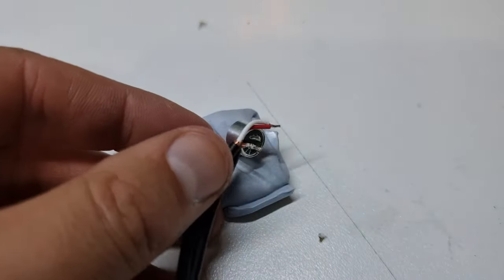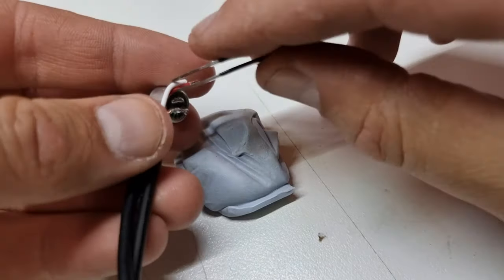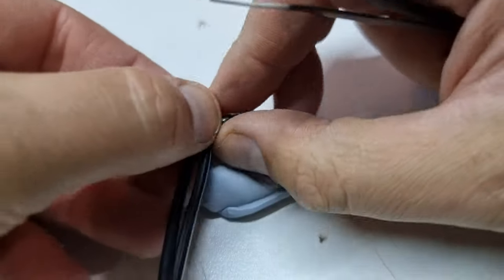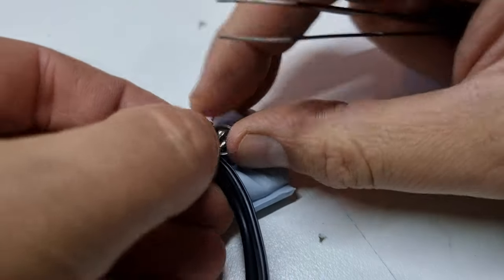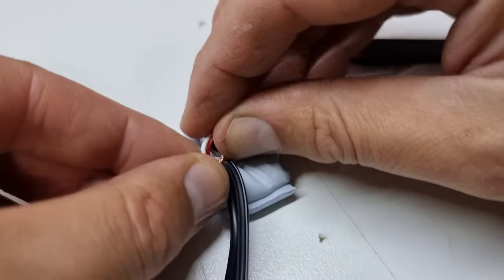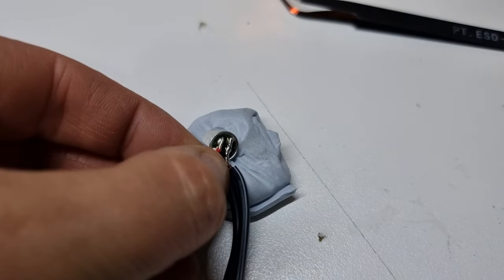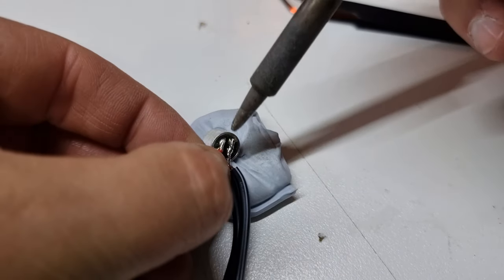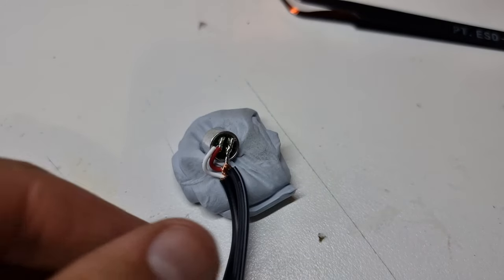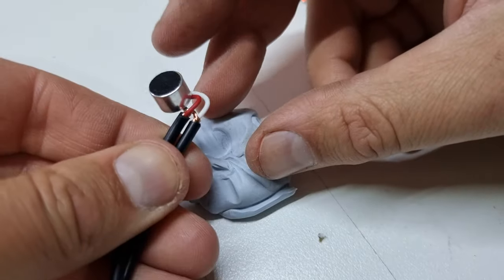Now what we need is a pair of tweezers here, which I'll grab off camera, and we'll try and give this a nice appropriate bend. I may have made this a touch too long, but doing it this way takes the strain off that smaller conductor, and it's less likely to rip it off the back of the microphone here. Now this is where you burn your fingers, by the way, but we'll see how we go. I've got partially numb fingers anyway. All right, there is our condenser mic. Now that's pretty much all you've got to do to make yourself a microphone out of one of these leads.